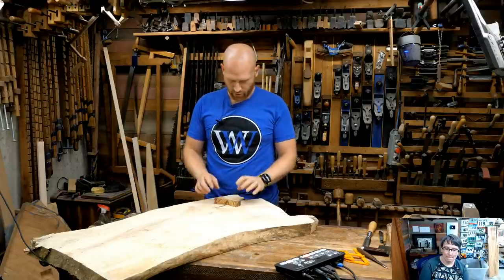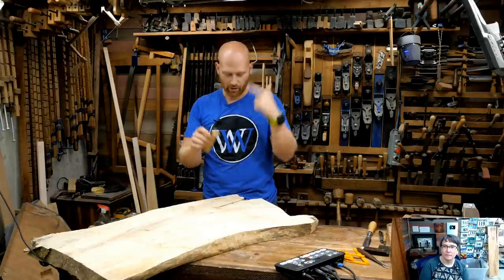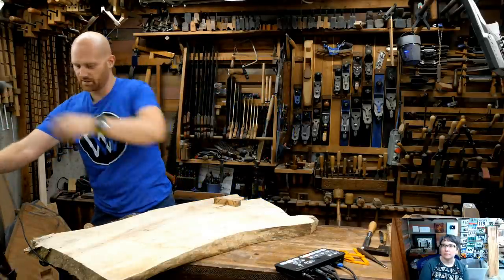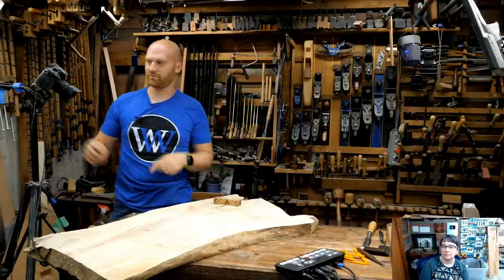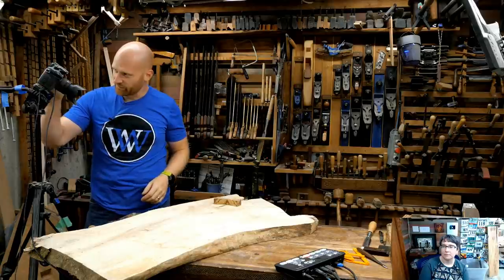That's great. So now we want to get this bow tie and put it into this. And now we have reality, we want to mark onto this. This is where people tend to have problems, because this is the important thing. If I can get a really nice clean mark from my bow tie onto the board, then I can get a really nice clean fit. And the easiest way to do that is actually with double-sided tape.